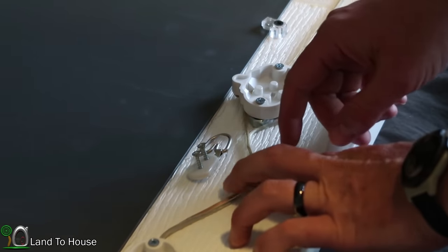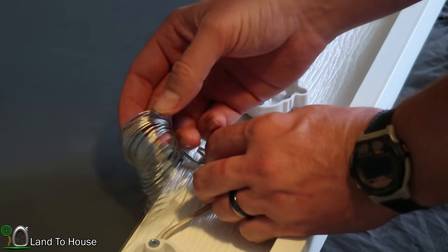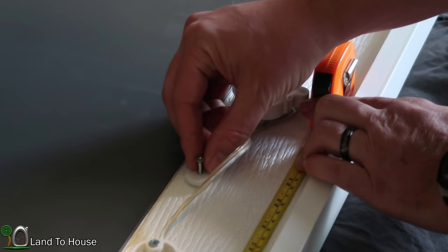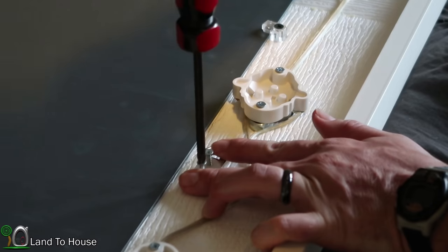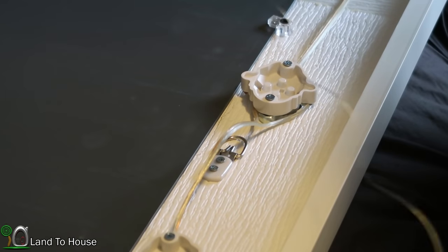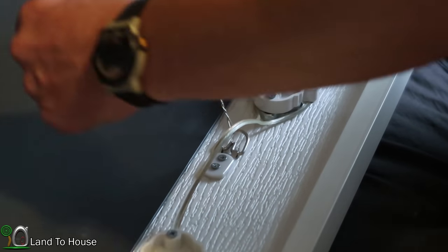As a means of hanging this vanity mirror, I decided to go with these D-rings — they have two screws and a D-ring. I'm going to use picture frame wire to attach the whole thing, which should give me a little bit of adjustment room if it does not hang straight on a single nail. I've got them at 22 inches from the bottom. Now I'm going to run the picture frame wire through these D-rings, going around and bringing a good six to eight inches back up to wrap so it definitely will not come undone.